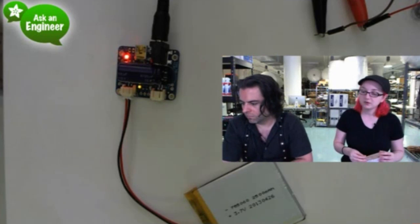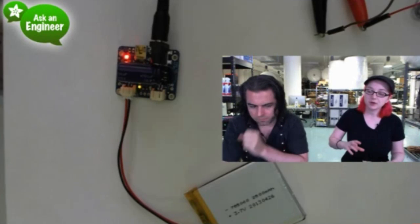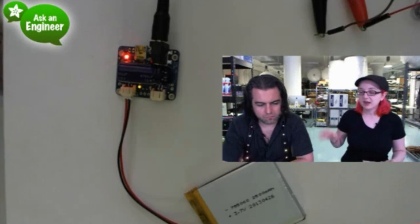And it uses not max power point, but something close enough that you get all the efficiency benefits of max power point without the expense of a buck converter and stabilization and a jitter source, whatever. Max power point is not really worth it until you get to like 10 watts of solar. So this is very good for 1, 2, 3, up to 5 watts. It's just as efficient pretty much, and it's perfect for charging LiPos.